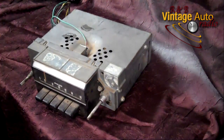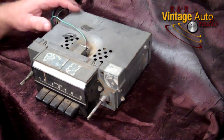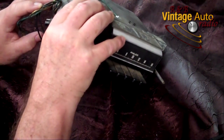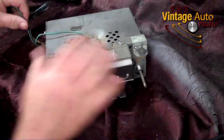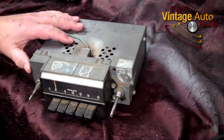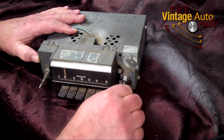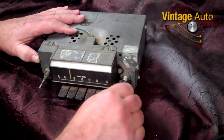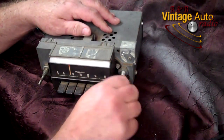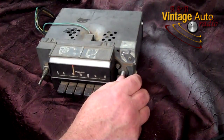We're going to do a basic conversion on it and tear it down to show you basically what we're going to do. The numbers on it are a 69 ZA. These radios have a gear in here that feels kind of gummed up. The worst thing you can do on one of these radios is try to force this gear to make that needle move. If it's gummed up and it won't move, don't force it because all this is plastic - you'll break and eat the teeth out of it.